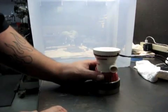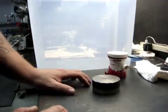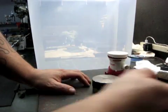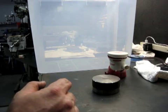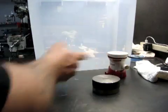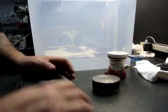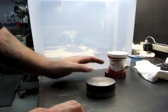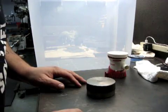Anyway, what I've got to figure out is that this pump is just going to sit in the bottom of that basically. And I'll run my wiring and my hoses out of the top. All I'm going to have is a feed hose coming out of this pump and then a return line coming out of the drip pan of the lathe. I don't want to drill any holes in the bottom of this thing, obviously, so I don't have any leaks down the road for coolant.